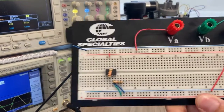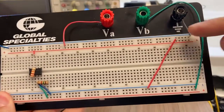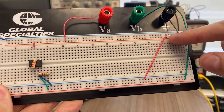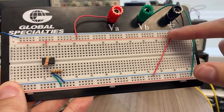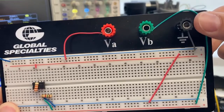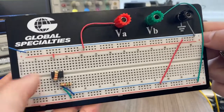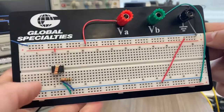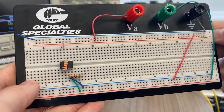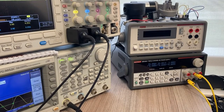When I set up my breadboard, the top rail will be positive 20 volts and the bottom positive rail will be negative 20 volts. The negative on either end is going to be ground. I go from ground to negative and jump it across to the negative power rail, then set up my positive — which is VA — on this power rail. That has to do with the pinouts on the LM741, so pay careful attention.